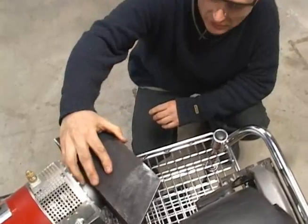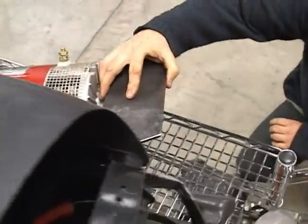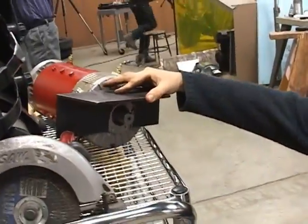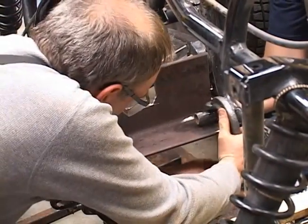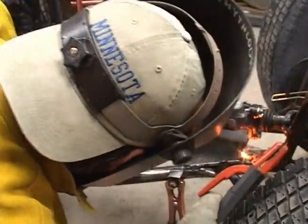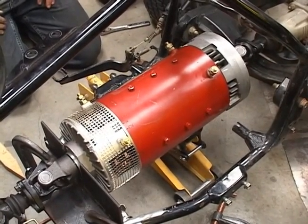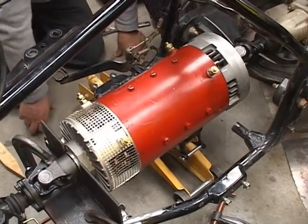We did a quick-and-dirty solution — took the universal joint and made it small enough to fit the original yoke. Eventually we'd like to get yokes with a catalog number so we can just go to the store and buy a compatible universal joint when it wears out. After confirming the motor mounted okay, we took two angle iron plates, drilled clearance holes for the shaft to turn, and welded them to the frame. That was the hardest part — once the motor is connected, the rest is electrical.